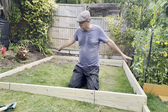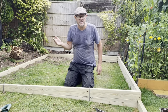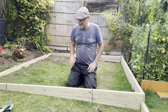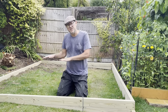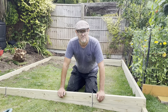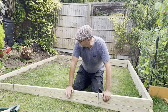It's nice and square. It's got a slight run, which is okay. It's sort of going down, but that's okay because it's outside, and any water that does get underneath will just make its way off and won't pool underneath. So to have it absolutely flat level wouldn't actually be that helpful. We just need it to run a fraction, just slightly, but it's imperceptible when you're inside the building. Once it's built, it'll be level. So we'll just let it run off slightly, and that'll be good.